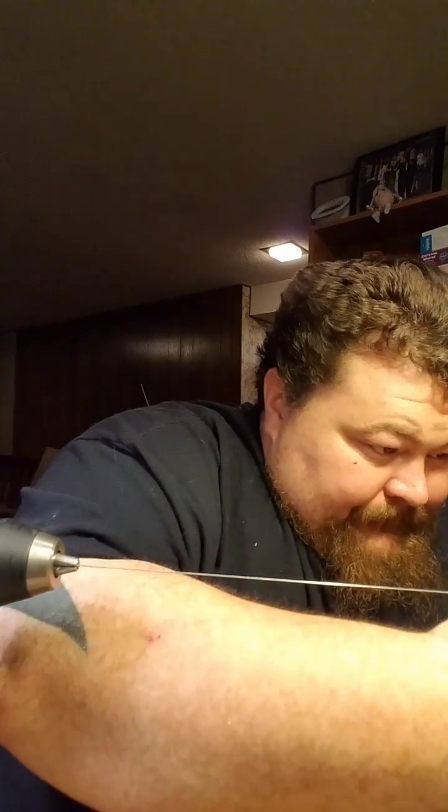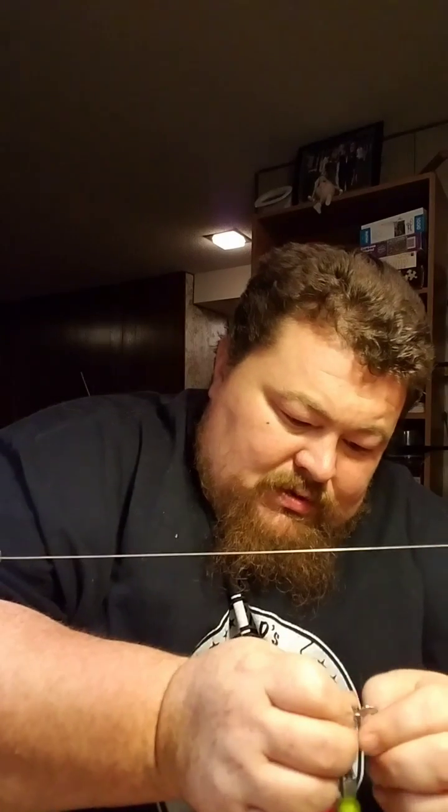That's how we do that. Now when I cut it off the spool, I leave about that much on it. Where is it? Right here. I don't know if you can really see that. There. You see that shine on the wire right there? I'll leave about that much because if your spaced Clapton is tight on here, you're going to want to hold on to that and reverse the direction of your drill to loosen it up so that you can slide it off, because we're going to be decoring this, which can be a nightmare.